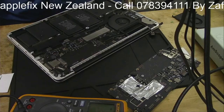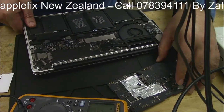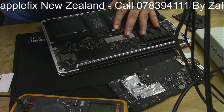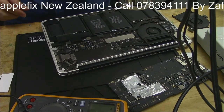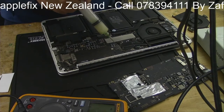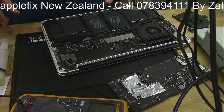Do you see guys? The short is relieved - that was the faulty part. Now the next thing is I have to look for the same board to remove the same capacitor. If I don't have the same board I'll search for the same component from the schematic diagram. I found one board here and I'll remove it from there.